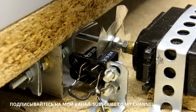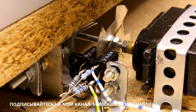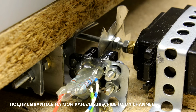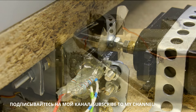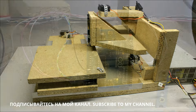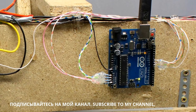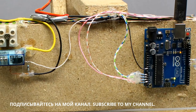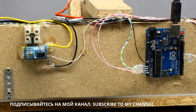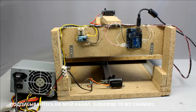The rotational encoder is scanned by two photosensors. The state of the sensors is read by the Arduino Uno. The third axis is moved by a normal servo. The Arduino is mounted at the backside of the CNC machine. There is a 12V relay used to switch the router, controlled by the Arduino through a small signal transistor. An old computer power supply feeds the machine with electricity.